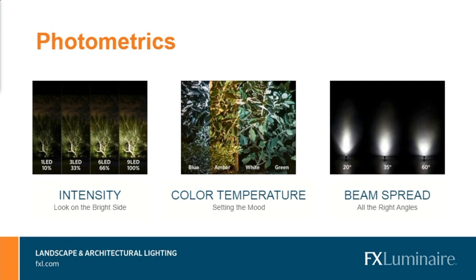Color temperature is another way to highlight areas. More often than not, color temperature is the same across an entire installation, but when you start mixing architecture or hardscape with softscape — meaning landscape — cooler temperatures look nicer with hardscape while warmer tones look better with landscape. From a downlighting standpoint, very cool color temperatures look great because they mimic the moonlighting effect. Beam spread is also important — more narrow beams for things going very high, very wide beam spreads for things that are low or where you want more of a wall washing effect.